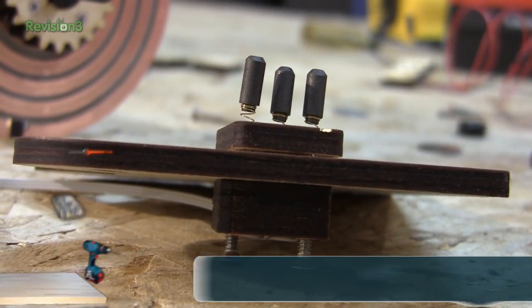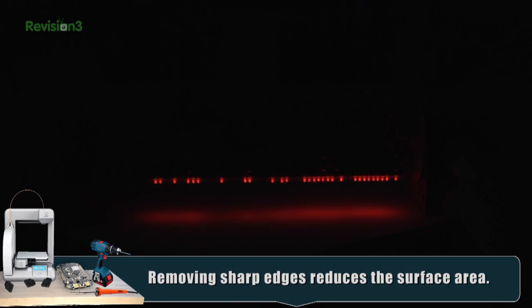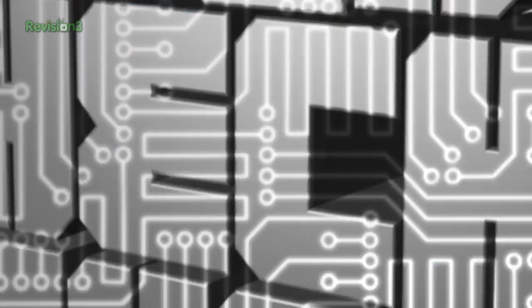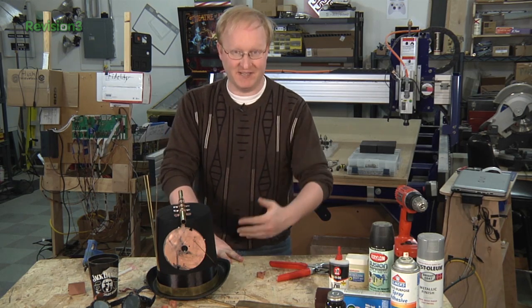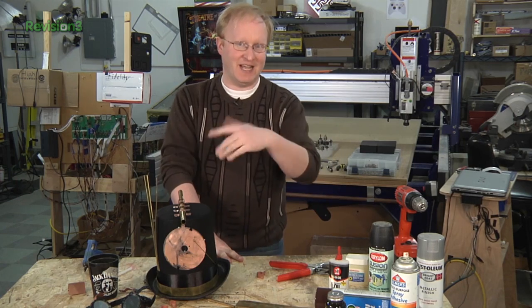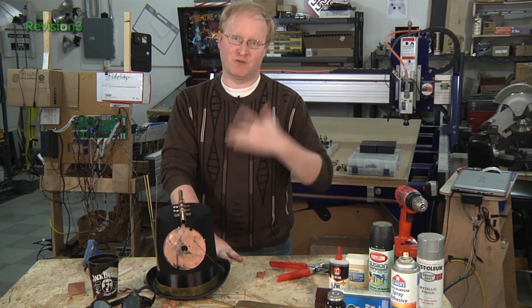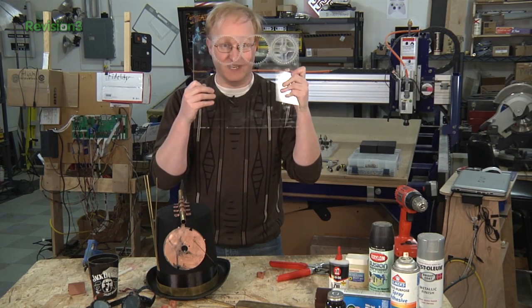I shaved down the carbon contacts to reduce the friction. Let's try them out. I don't have data hooked up but we've got the power on it so we can at least kind of see the effect. Filing down those carbon brushes really reduced the friction quite a bit and got that puppy spinning. In the next episode we'll hook it back up to the microcontroller and see if we can get some dots, lines, and patterns to synchronize with the rotation. In the meantime I'm going to add some gears to my steampunk outfit. We'll see you next time.